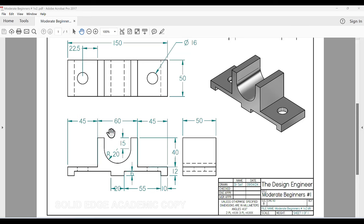If I know how to sketch the front projection, it will be easy to make the part by just drawing the sketch and extruding 50 millimeters to get the shape. Then I can lock to the top surface, make one hole on one side, and use the right side plane as a mirror reference to mirror the hole to the other side. So without further ado, let's go to Solid Edge.